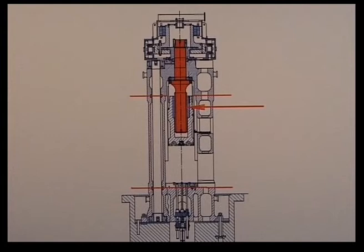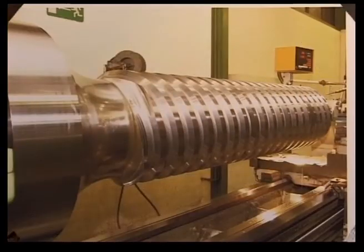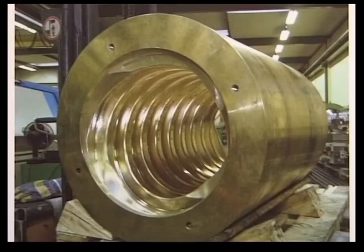Another key component of LASCO presses is the screw and nut assembly. The screw is forged from a special alloy of chrome nickel molybdenum steel. The nut is made of low friction bronze and has extremely good emergency running properties. It is encased in steel and rigidly joined to the ram, effectively increasing the ram guide length.